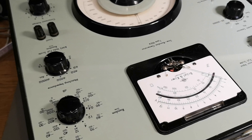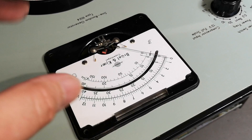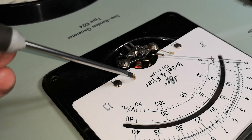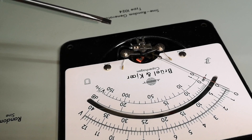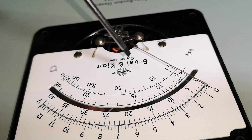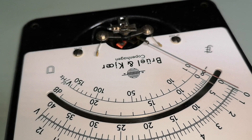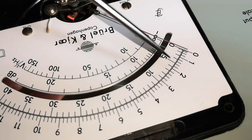I'll assemble it tomorrow and try to power it up. I needed to fix the meter first — above the meter there were problems with the end stoppers. The little piece of soft material was bent down by the glass. The glass was definitely broken for many years and stuck in old glue. When the needle goes all the way to the end, it got stuck under this bent piece, so it needs to be right up like this. I was able to fix that detail so we won't have a stuck meter anymore.